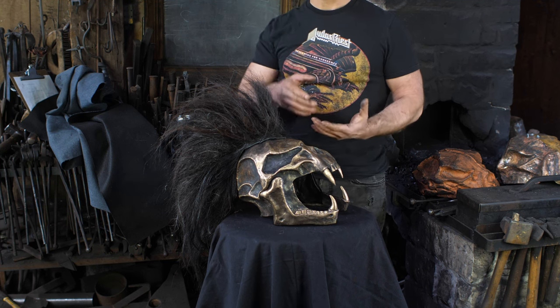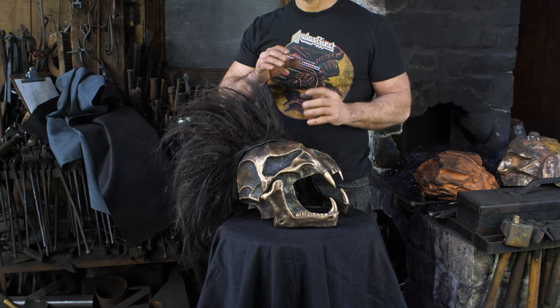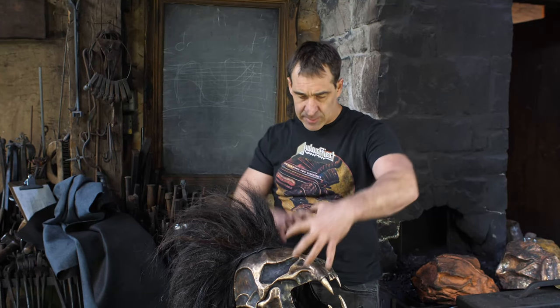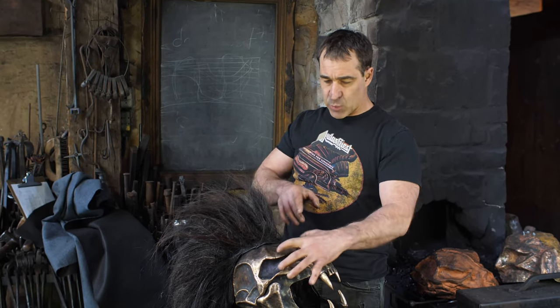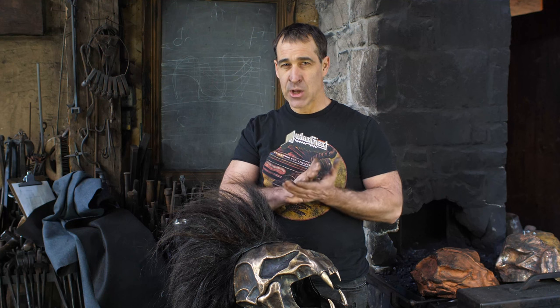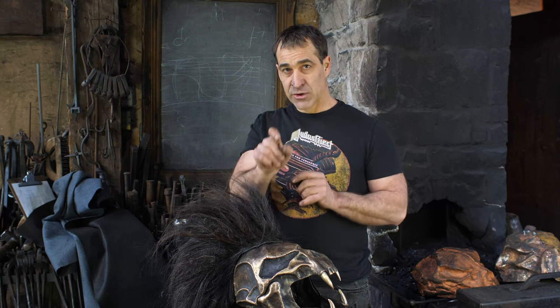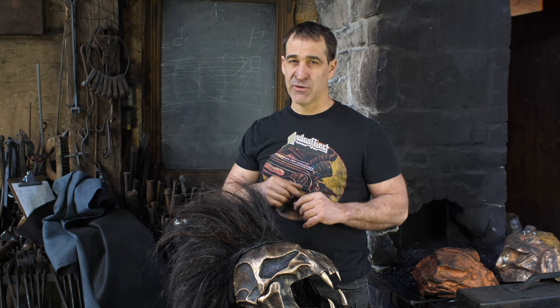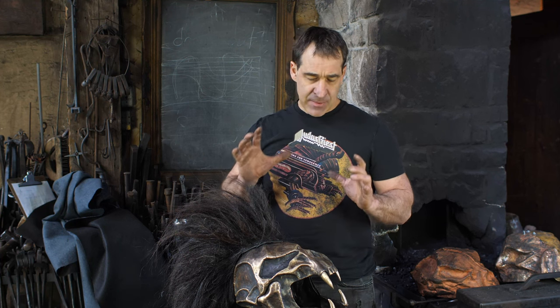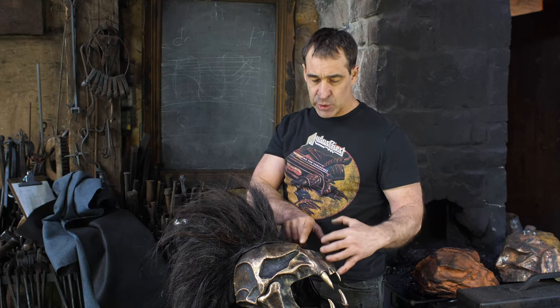We do silicon bronze TIG welding, which is really quite a versatile thing. But with the MIG, what it allowed me to do was hold these awkward pieces with one hand, because there wasn't a way to clamp them, and I was able to come in with the MIG and kind of stitch it together. After I worked out the idiosyncrasies of welding silicon bronze with a MIG wire, the key is a knurled drive wheel, folks, and maybe I'll actually do a video on that sometime to show you my experiences with that. But anyway, it really was a game changer for me to be able to stitch this together.